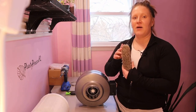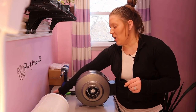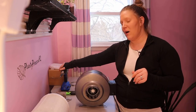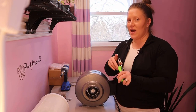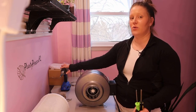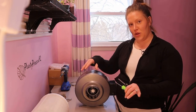I'll explain what I'm doing and give you little tips on how to clean your inline fan and filter. A couple of important things you are going to need: some kind of brush to dust out all the build-up on the inside of your fan, a little toothbrush for smaller finer spots, and a power drill as well as a couple of screwdrivers. I'm going to start with the screwdriver because if you have too much torque on your power drill you can strip these screws.